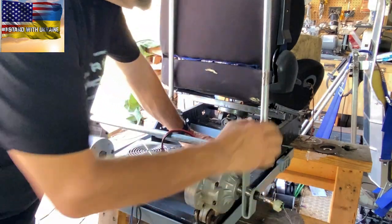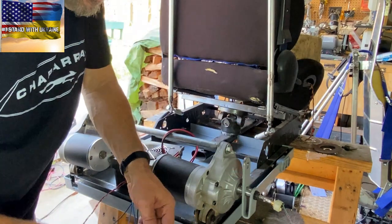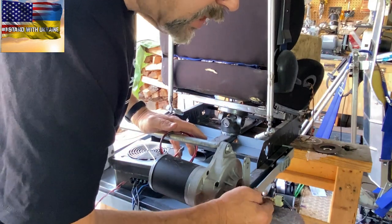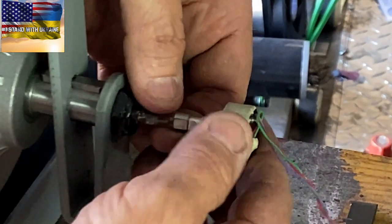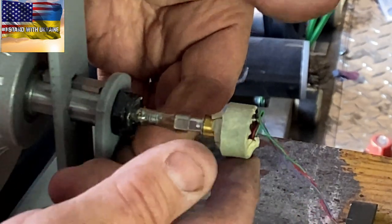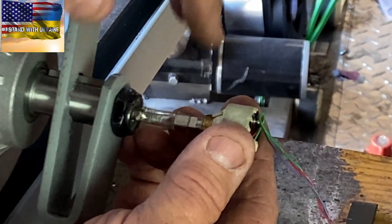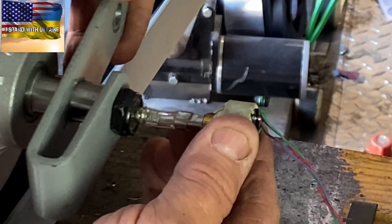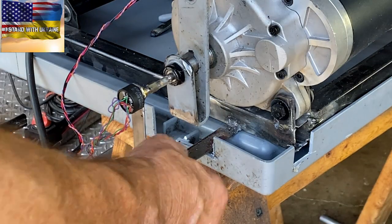To set it up, I'm not going to have the chair hooked up until I get the readings. I taped this one because it's the right side — I also taped the right-hand side wires so I know which is associated with which. Let me make the mounts for these potentiometers. The rubber tubing will take up for any miscalculation or misdrilled hole — even if it's off just a little bit, it'll still be fine. The potentiometer stays still and the shaft moves around. See that flat part on the potentiometer — that's about as much as it's going to move.